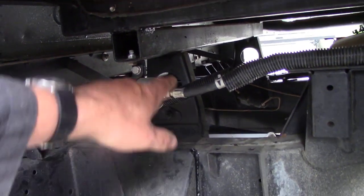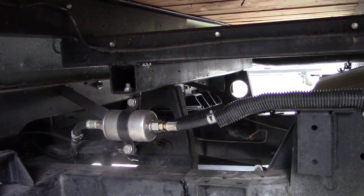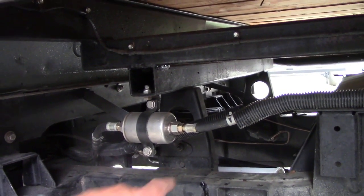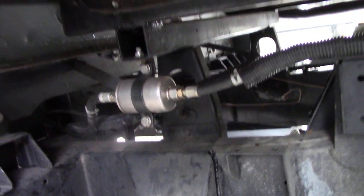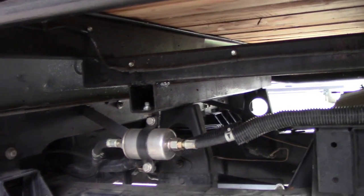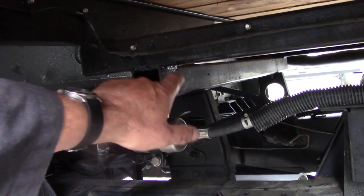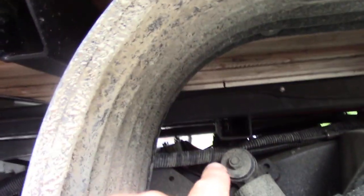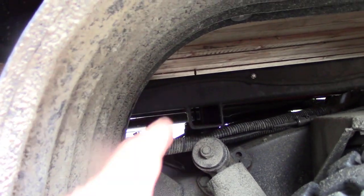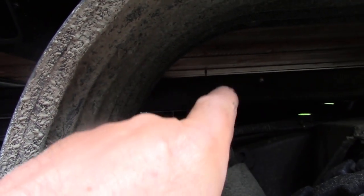This chassis was off a regular two-door van type thing and it had these brackets already on - you can see where they bolt on with three little screws. What I did was use a piece of 2x2 onto that, bolted onto the existing bracket plus another bracket here. I had to just notch out the 2x2 to drop it so the longitudinal piece would just drop onto it.